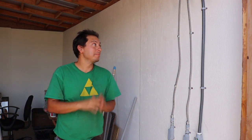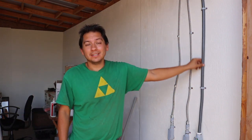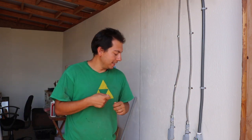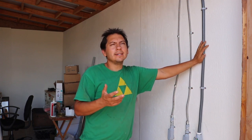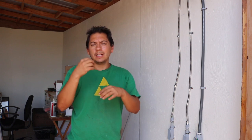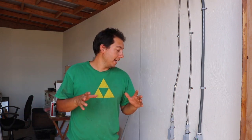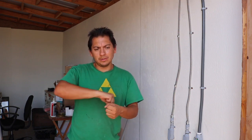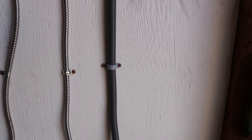We've been having a heck of a time. We pulled the wire up into the shed, and the tricky part was this conduit — with the electrical tape still wrapped around the wires, we needed to get the eight-gauge wire through this half-inch conduit. It should have been wide enough but it was really tight; we couldn't push it through. Eventually we fed a wire through and attached it so we could pull as well as push, but even that didn't quite work because that wire snapped. So I picked up a little wire lube and we just lubed it up as we were going, pulling and pushing that wire through. Eventually we got the wire through the half-inch conduit and then I proceeded to attach the conduit up along its brethren.